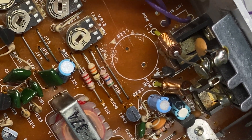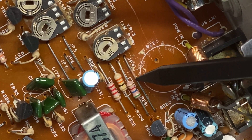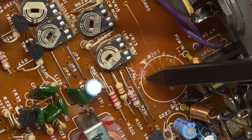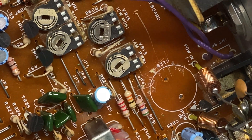Using a bit of alcohol and a scraper, I've managed to get rid of all that nasty corrosive glue. As you can see, where the glue has touched this jumper it has actually started corroding it away. So yeah, I think it was a good call getting rid of that glue.